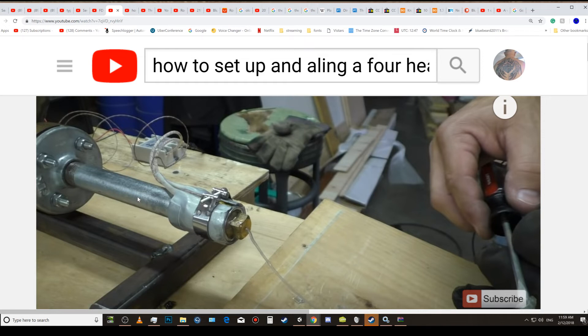If you run that plastic through a water bath, you cannot use it to extrude with. I recommend a nice thick stainless steel pipe — it's cleaner, and all you need to do is run brushes down it to keep it clean. Avoid regular pipe because you're eventually going to get rust. A lot of extrusion pipes are stainless steel because it doesn't rust and drop little bits of metal into your filament.